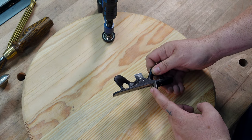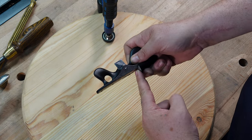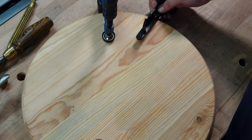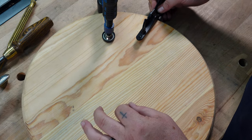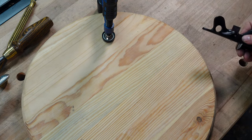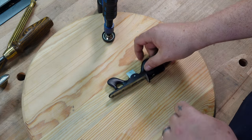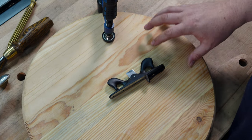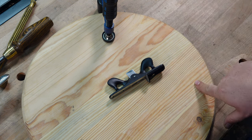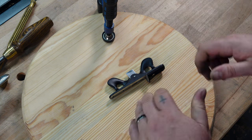For the very first cut — same as with straight boards — you want to make sure all your pressure is against the fence. You're just scoring it to create that curve and have the blade follow from here on out. You still have to pay attention because you can still make the plane go off and create a separate bead line. Take your time and practice, because it's not easy. It takes time to learn. Every time I'm going to put a bead on a curved piece, I cut a different piece, match the angle, and practice on there first until I feel like I've got it down.